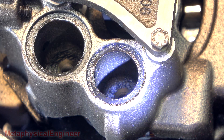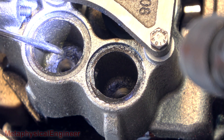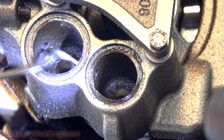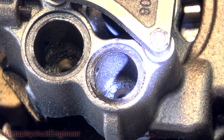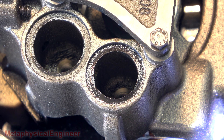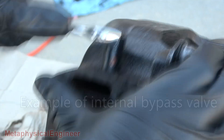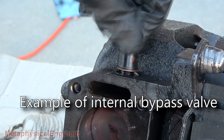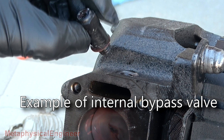Not quite sure what to make of these chambers. Down here we have the discharge port from the cylinder head, a crossover port between the large and the small, and the small one would obviously exit through that cap I just removed. I expected some sort of oil return or pressure relief in there — maybe they're mufflers. Very interesting to see there is no internal pressure relief here. Perhaps designed such that overheating and increased current would trip the overload protector before dangerous pressure built up.